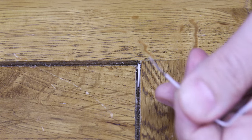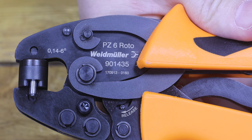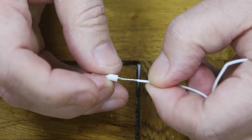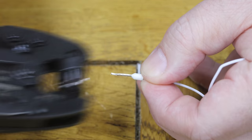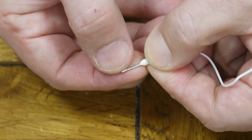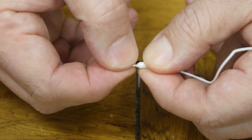Since then I thought that's a weird crimp — I'll order a different one. So this time we have a different maker's crimp tool, part number 901435. It's got a bit at the end that can work sideways or face on, which is nice. When you crimp with this one you get something different — a ridge crimped on each side. It's flattened but structurally solid; that's not going to snap.